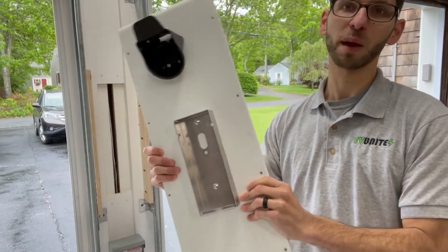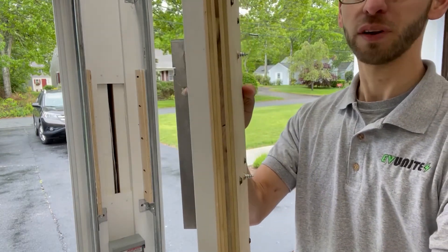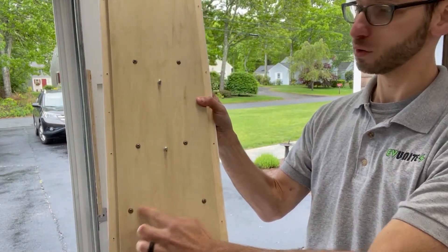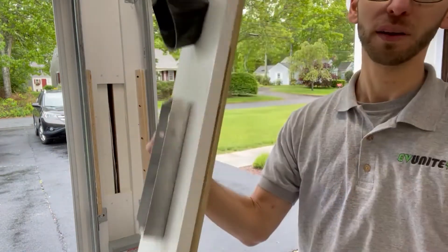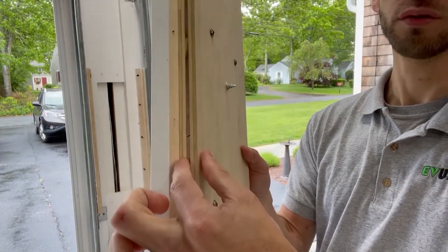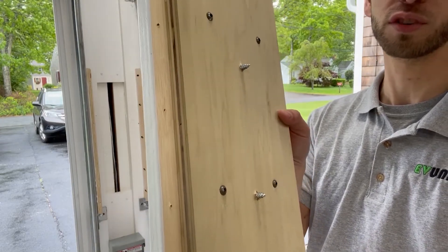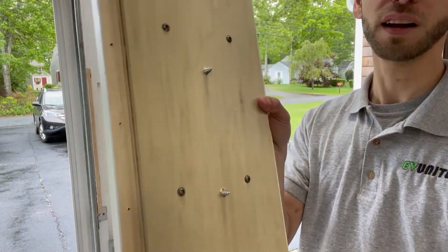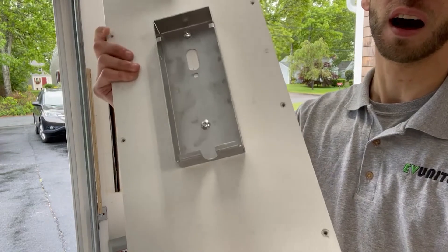Let's take a look at this panel itself. On the back here you can see it's actually three quarter inch plywood — there are two plies being fixed together using pocket hole screws, and there are eight of them holding it in the back. You can also see there's a molding piece on the top and the bottom, giving it a nice clean aesthetic when you're looking at the panel from the front. By having two three quarter inch pieces of plywood screwed together you're getting an inch and a half, which gives you a really strong and sturdy surface to screw into from the front. That's important because a lot of chargers come with heavy duty screws and you want to make sure the charger is mounted really strong and securely onto the wall.